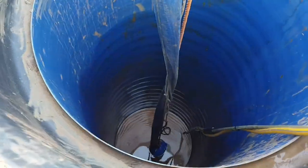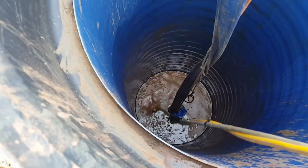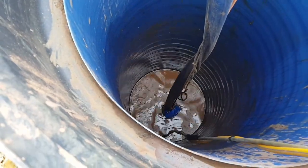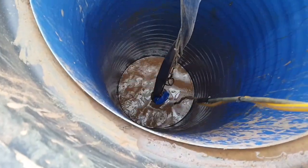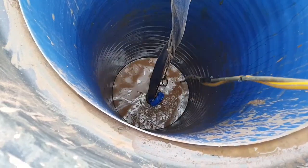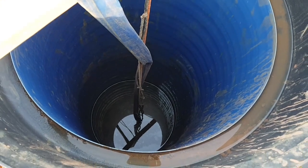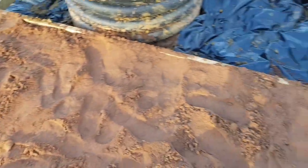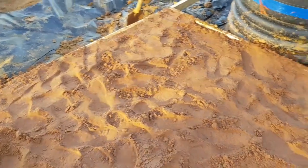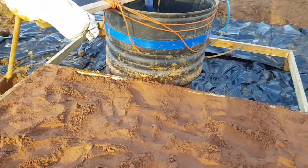We've filled up around the well and we're on to the final stage of cleaning. I've rigged up a little 24-volt pump to pump water from the rainwater storage, basically just washing the gravel at the bottom and stirring up all the silt. We'll keep doing this for about 10 minutes at a time, pump it out, and repeat about 10 times — then we should be ready to go. As you can see it's going pretty clear down there. We've also started building the pad for the water tank and the earthbag building, taking it right to the edge and around the other side of the well.